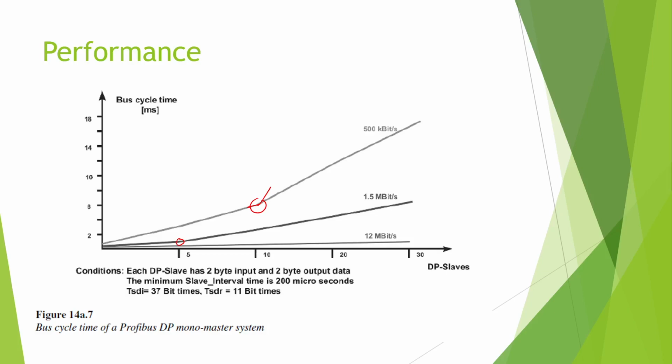All right. As I said, though, the biggest downside of that is your max range. But again, to me, 300 feet, that's plenty. If I have to run a network more than that for one single PLC, I'm starting to get worried. Now, unless you're like, well, we're going to have an HMI at the end, and that's going to be on Profibus. Then I could start going, okay, you're going to have to run a Profibus from here to the control room, and that's 1,000 feet away. That one I could say, okay, I understand why you need to go that far. But for a VFD or IO or whatever, being more than 300 feet from that PLC to me is a bit nuts. Unless you have only one PLC running an entire facility, and then I'm calling you crazy for doing that because uptime is key, and one single failure point that takes the entire facility down, no bueno.